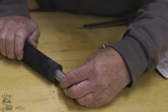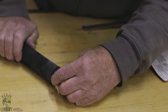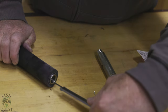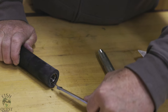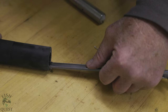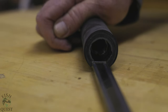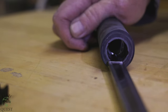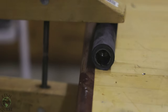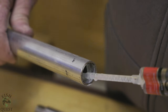It is important that you keep the three-quarter-inch gap at the bottom of the rod epoxy-free. It is best to have a second set of hands to help you do this. We previously measured the distance between the fittings with calipers; now we use the depth stem with the added one-sixteenth of an inch to push the female fitting up inside the rod end. Once the female pipe fitting has been epoxied and inserted, lay the rod flat and re-measure to ensure the fitting hasn't moved.